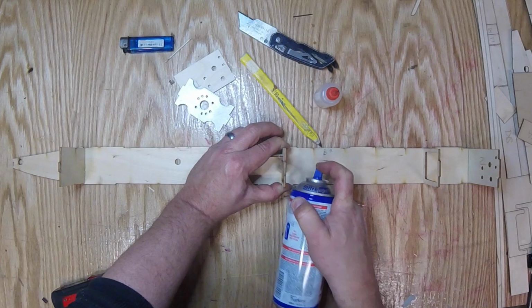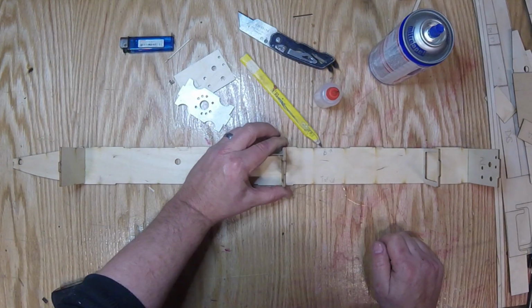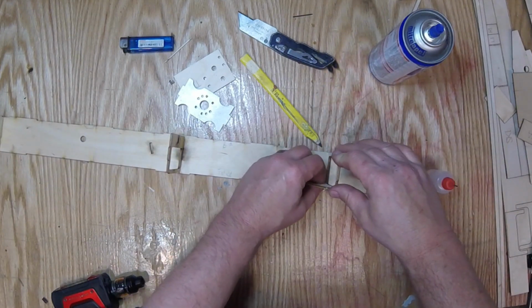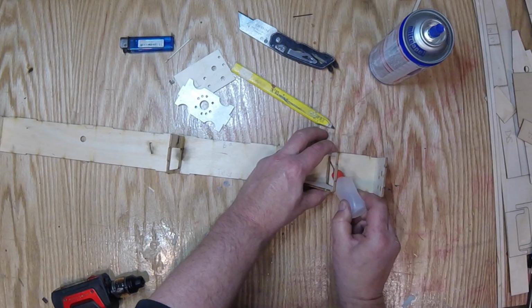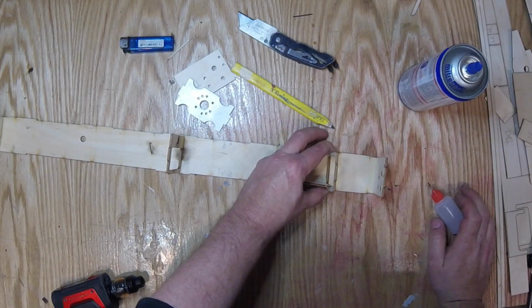Same thing. Now, the manual says, in this case, you can use wood glue, Titebond 3. From my other videos, Titebond 3, you can usually get it at Lowe's or Menards, one of those, Home Depot. It's called Titebond 3. Titebond 1 is normal. Titebond 2 is water resistant. And Titebond 3 is waterproof, supposedly. I have never tested that theory.